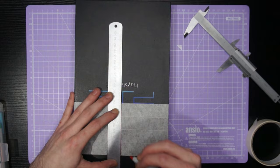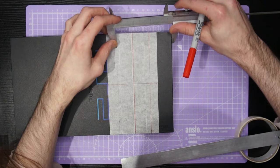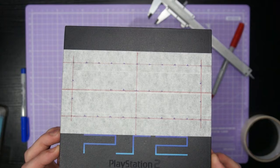I'll be installing a bunch of toggle switches on this console as well as four 3.5mm jack inputs to accept gate or CV signals from a modular synth. You can also use potentiometers to control your circuit bends — they do provide a little bit of variance between on and off so you can actually change the level or intensity of the bend, although the range isn't great. Still really cool and a good option to have.